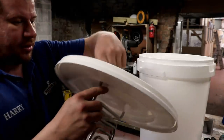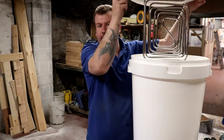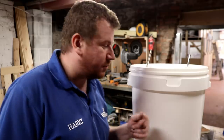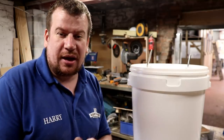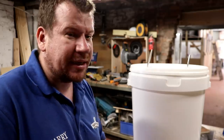Once they're pushed all the way down I can put the crossbar back on top and put some connectors up there so we can connect this to the glycol. Then all we do is dunk that in the fermenter like so and we have internal cooling for the beer. For the brew day tomorrow I'll need to make sure this bucket is filled up with steriliser - namely peracetic acid, Persid 15 is what we're using at the moment - so the whole shebang is submerged in sanitiser and good to go. In terms of heating, we don't need it right now as it's about 15-16 degrees in here, but we will need to cool it for sure.